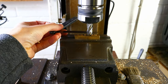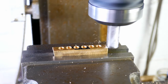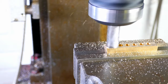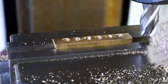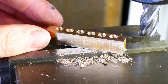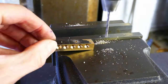I'm using my calipers to mark the positions of the holes. Before drilling the holes I'm just taking a light skimming cut across the face of the back edge of the part — this time using a sharp 10mm end mill, which does the job in one pass and gives a nice finish. With the positions of the screw holes centre-marked, I'm drilling them to the required depth using the hand wheel gauge on the drill quill feed.